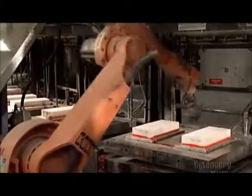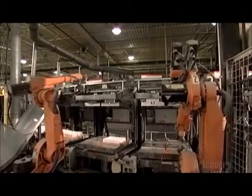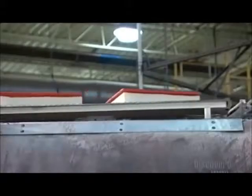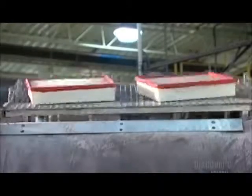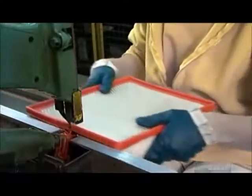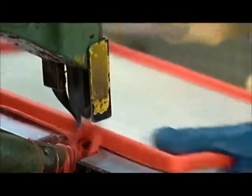Because of the wax sprayed on the molds, the robots don't have to work hard to pull the air filters out — like well-greased cookie sheets, nothing gets stuck to the bottom. After they're cooled, the rack tips up and the air filters tumble down a slide to a worker who collects each one. With a band saw, she trims the excess polyurethane, or flash, from the rim.